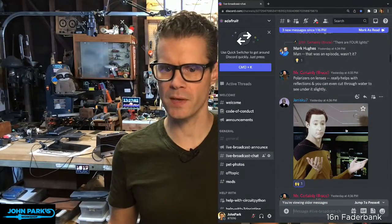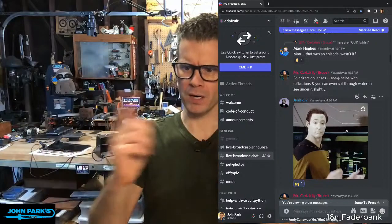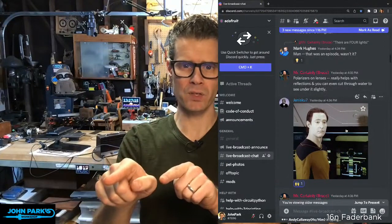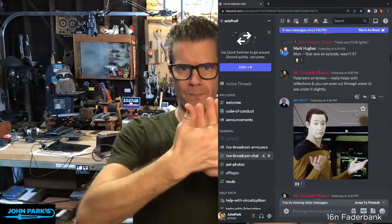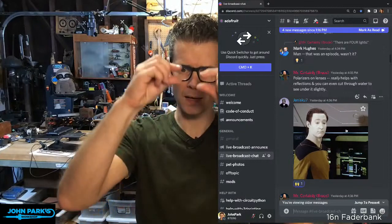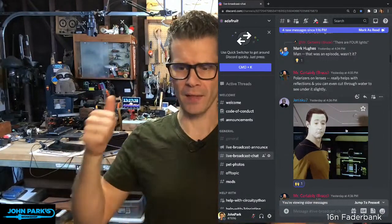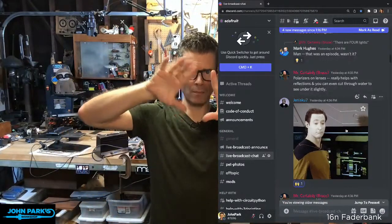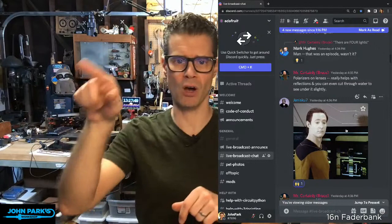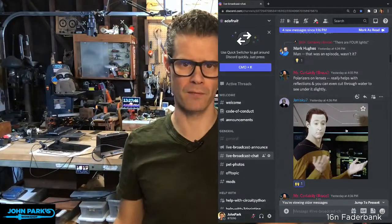Here it is. So you can see there that sort of pulsing. This is a sort of a ping-ponged clip. It loops forward and backward, so you'll see things changing direction. But essentially, that panel that you're seeing there is the same as this. It's a vinyl print backlit with polarizing film in different orientations on the backside of that image. And then there's essentially a light box with a spinning motor, and it has a piece of polarizing film rotating. And as that rotates, it causes different angle blocking of the different pieces of that polarizing film.